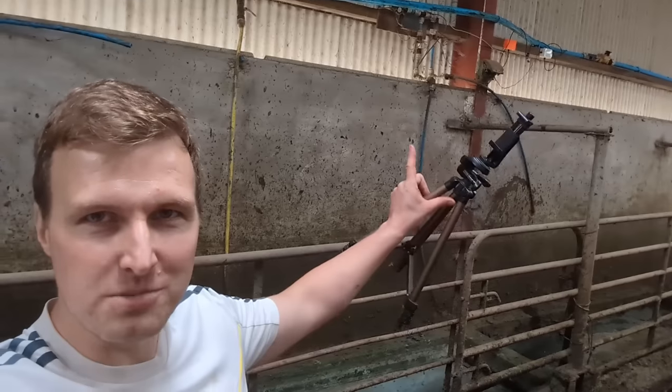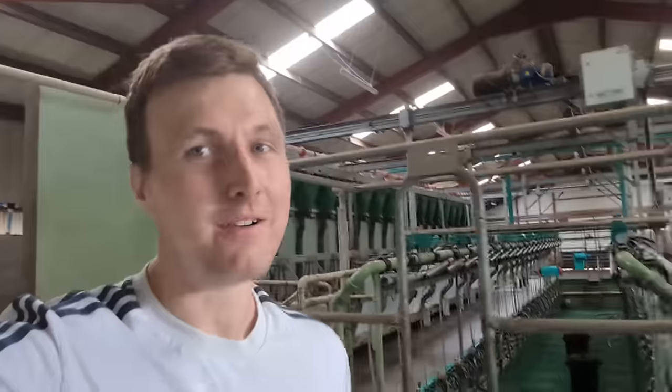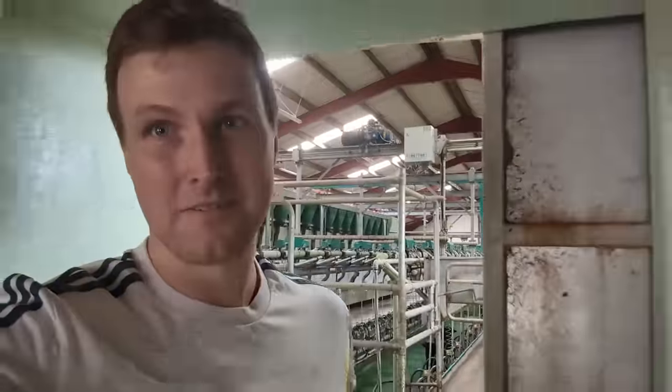So it should be all good to go. You can see the orange box up there is our main controller that has the main flow meter, main relay valve. That relay valve is working 100%. So more than likely I broke the other relay or it came broken. Hence why I'm going to order a new one and not waste all day trying to fix the one that's there.